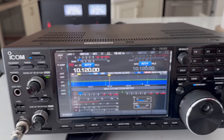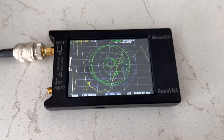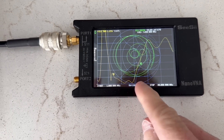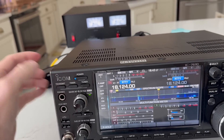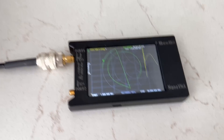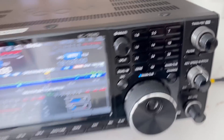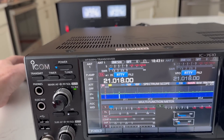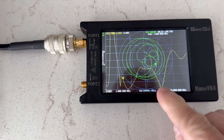We'll take a look at 14 megahertz — and it's tuned just that quickly. You can see 14 megahertz is this bump just before the 15 megahertz division, very low SWR. Continuing on up the band to 18 megahertz — just that quickly it's tuned, and we've got a nice bump down here between the 15 and 20 megahertz divisions. Now at 21 megahertz — tunes pretty quickly. You can see a nice little bump, very low SWR at 21 megahertz.